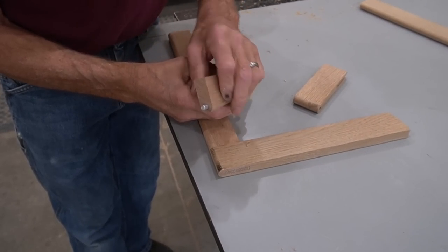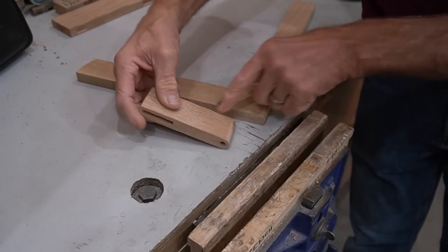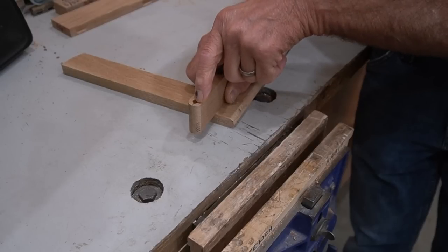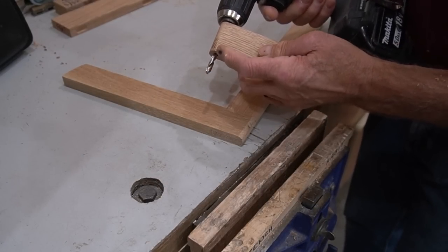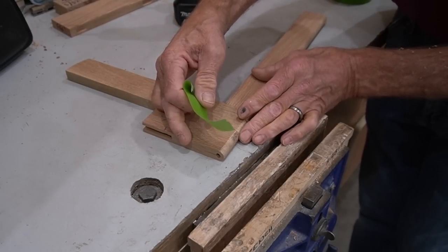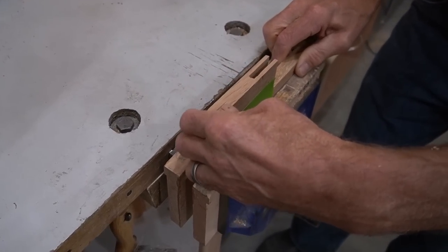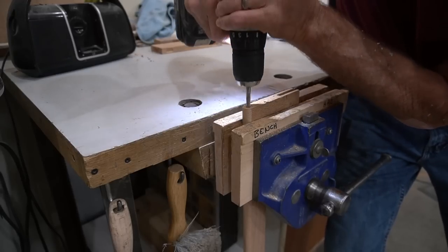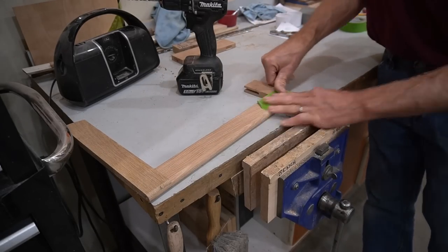The location of the holes for the pivot pins needs to be very accurate and consistent on both arms, so I made a drilling guide block. I started with a block the same thickness as the arm, put the bullnose profile on the end, and carefully drilled a quarter-inch hole through the center of that radius at the drill press. I set the bit so an inch of bit protrudes outside the block, use green frog tape to hold the drill guide block in alignment with the arm, and clamp both pieces in the vise. Then I carefully drill that quarter-inch hole one inch deep into the top of the support arm, reposition the drill guide block on the bottom end, and repeat — completing the drilling process for the support arms.